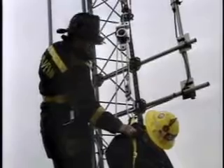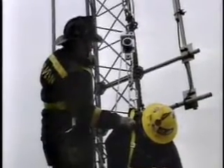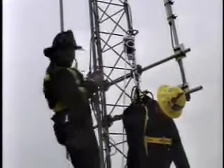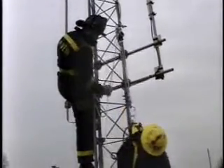He's being suspended by that brown half-inch rope with an eye on each end. Now they're going to lift him, and as I said, you'll see the slack develop. There's the slack in the fall protection tie-off that stopped his initial fall, and we get that line out of the way. They'll be lowering him here in a second. Notice the drum is stationary — it's not turning. The rope sliding around the stationary drum gives us the 90% brake.